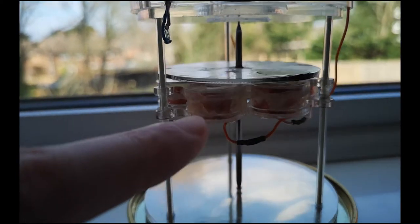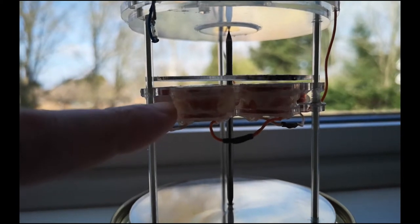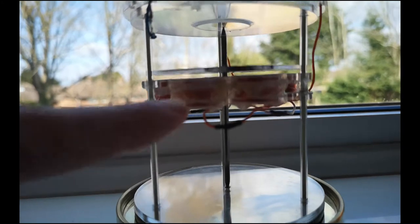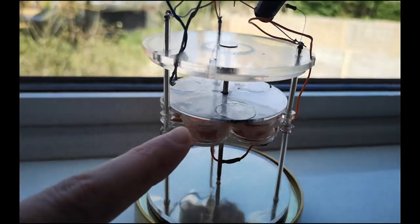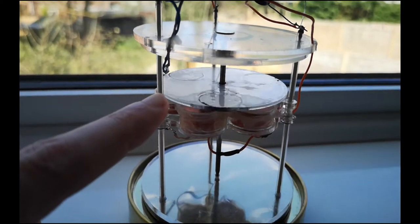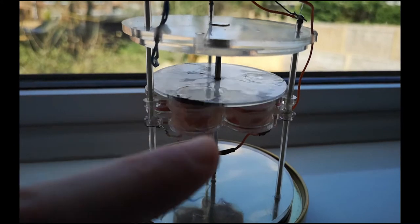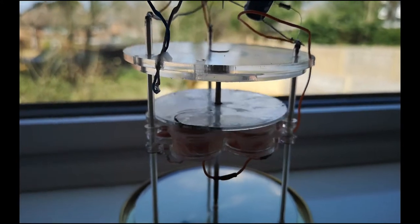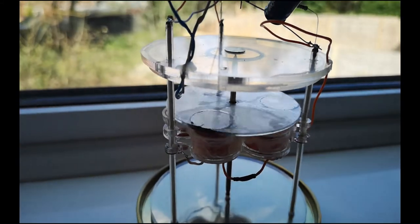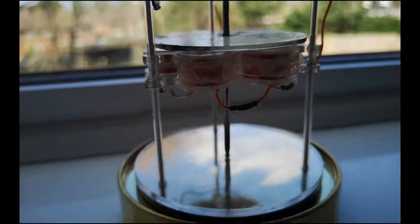made of super fine wire wound onto bobbins from a sewing machine. They're wound north-south, north-south alternating polarity, so that it simultaneously gets pushed from the previous one and attracted towards the next one. It's only 50% duty, so it turns on every other step it could do. So there's three magnets on the rotor and six coils on the stator.